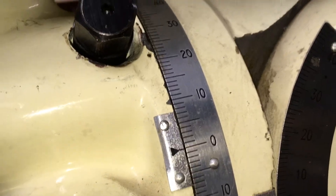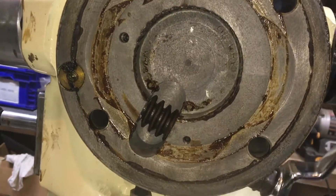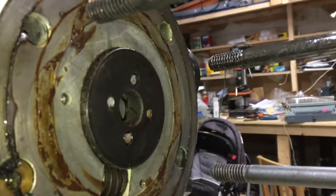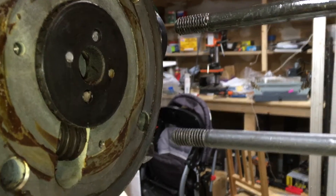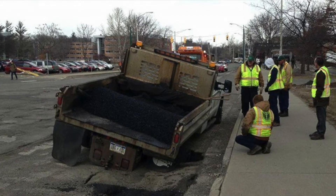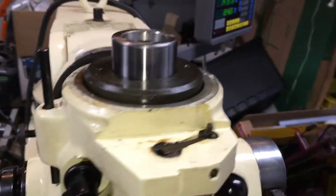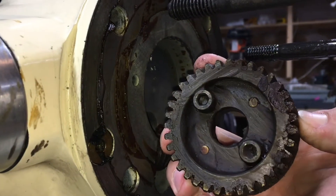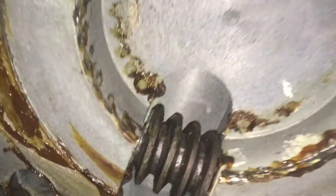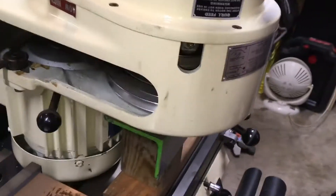The worm lives in the mill head assembly. Somehow I managed to break both the RAM adapter and the mill head sides of this system, which was a big surprise to the store associates. My theory is that the worm gear fasteners and dowel pins got sheared or severely weakened during shipping. I drove the truck very carefully and counted almost all potholes on the road, yet in the end all it was supported by was just a few layers of cardboard. When I tried to set the mill head straight for the first time, the gear got completely loose and stuck against its housing, putting extra stress on the worm shaft, which in turn just gave — and that's how you break both ends of the mechanism.